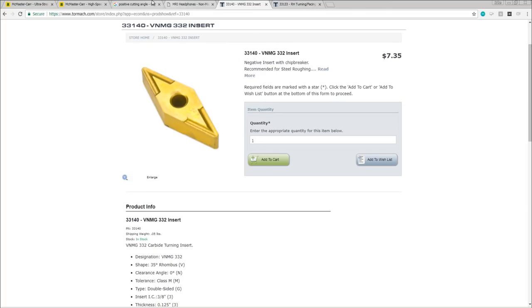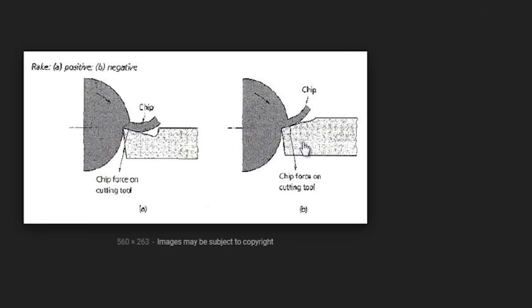The trick here is to get rid of the negativity — move to a positive cutting angle. There's a picture that does a great job of showing this. Right now we've got the style of insert on the right: a negative angle, a downward-facing angle. Why would you ever use this? It's a much stronger insert because it's fully supported below the cut, and it can push the tool harder, but it takes more horsepower. Worst of all, it tends to push the material away from the cutting edge. What you want to do is move to a positive — a more natural cutting action with lower cutting forces and less horsepower. More importantly, it provides a better shearing action, getting the cutting edge up underneath the material, which performs that shearing action with less deflection in relatively easy-to-cut plastic.